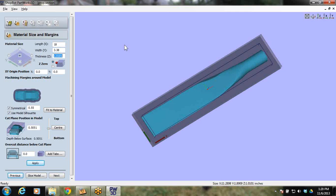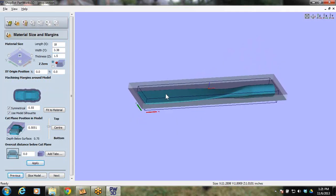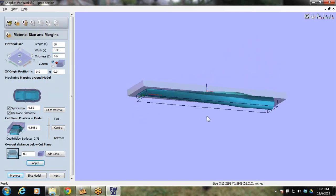And there's your 2x4. It's really only 3.38 across. So make sure you mic that. 1.5 is the thickness on it. They had it there. And I am going to zero to the top. I'm zeroing to the top for this part. And zeroing to the top helps you keep this accurate as far as getting down into this, and it really helps when you do the flip.